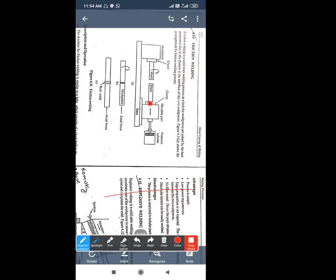And over here also there are some clamping devices, or a holder attached to a movable part. It works like a headstock and it also moves in a horizontal direction with the help of this base. Over here guideways are made on which this movable part moves while holding the workpiece. This movable part is attached to the pressure cylinder. Okay, this is a pressure cylinder. It may be hydraulic, pneumatic, or any other medium can be used for generation of pressure. You can imagine it may be a hydraulic or pneumatic cylinder, and it is operated by the operator by means of a pedal, lever, or any controlling board or switch for generation of the pressure.